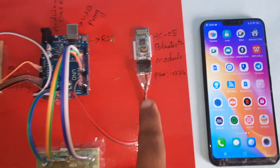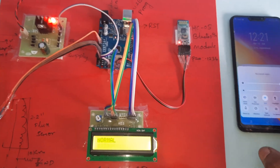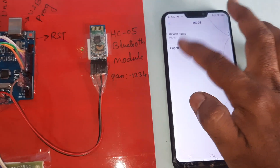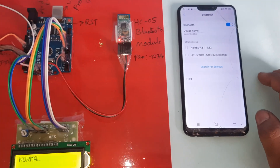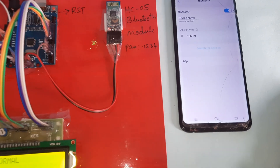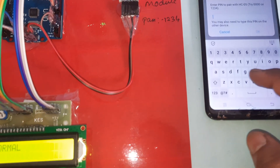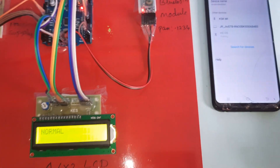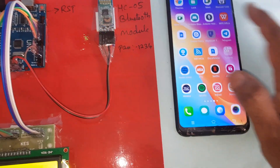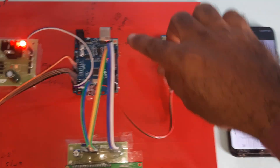The Bluetooth is blinking. Go to Bluetooth settings, turn Bluetooth on. The HC-05 is connected, so I will unpair it first — unpair, Bluetooth off, then Bluetooth on. HC-05 appeared; the password is 1234. Once it is connected it should stop blinking. Now go to the Bluetooth TTS app, press the on button. Then press the reset button.